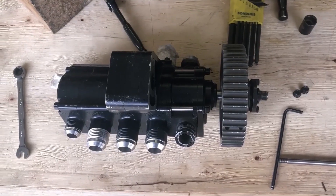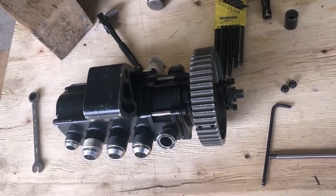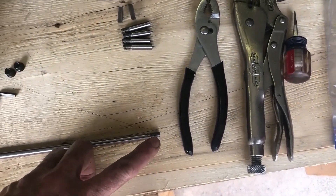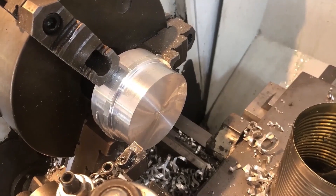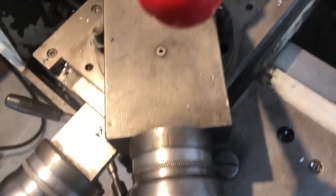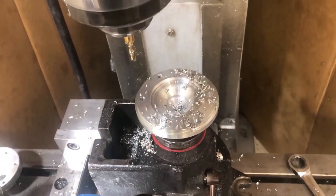We've changed the six-stage dry sump pump into a five-stage — everything worked pretty good. The pump rotor is a little bit tighter than the one I started with; I'm not sure if it'll loosen up with use. I've got a few spare parts left over and one more tie bolt to put in. I cut new threads in the ends to make them all shorter, so everything's working now. I'll turn the end cap for the oil pump drive and drill the bolt holes to attach the two pieces together.